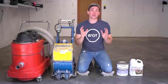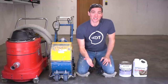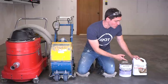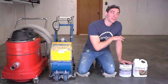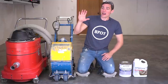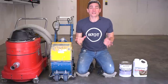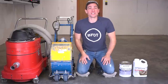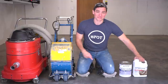The most important part of an epoxy garage floor project is the prep work. We want to ensure proper adhesion between the existing floor and the new epoxy. There are two processes: one is cleaning the surface with a degreaser, applying a re-coat primer, letting it dry, and going over the entire surface. The other option is shot blasting the entire surface to get a perfectly raw concrete surface. One is a lot easier than the other, but let's get to it.